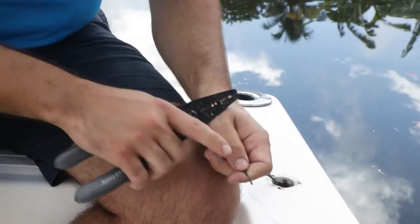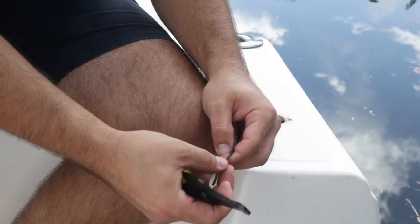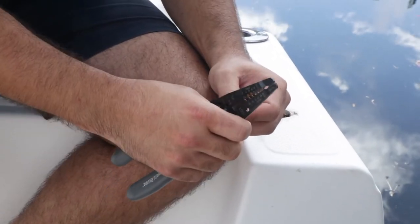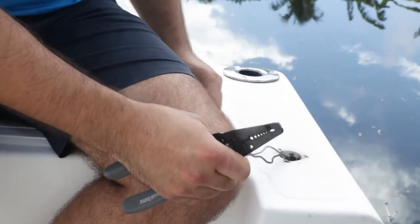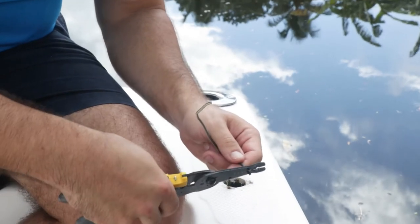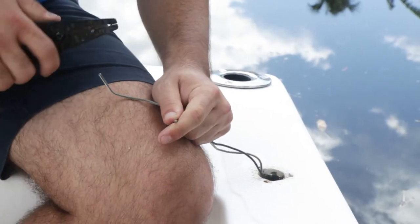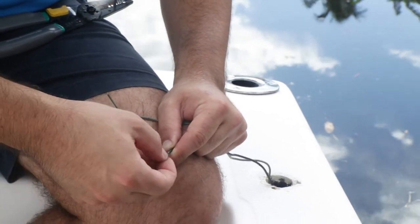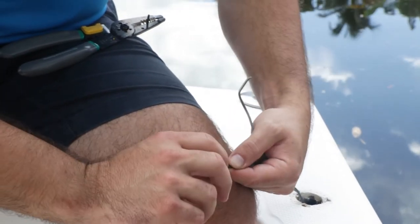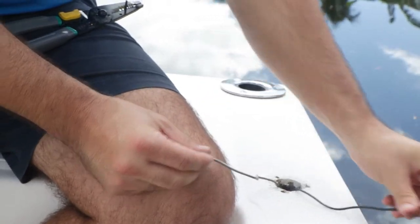Now I'm just stripping off a little bit. I've seen it — we've got a pretty decent amount of corrosion; it's pretty black. I see a little bit of blue in here. This black on its own isn't terrible — depending on the wire sometimes you'll see that — but I do see a little bit of blue corrosion in there, so I'm going to go down just a bit further and see if we get any better luck. We're going maybe a half inch up, strip it out. That's looking pretty good — a little bit of black on there but that may be from the outside wire. I don't see any blue. I can see gold in the middle; I don't see any blue anymore, which is great. I'm just going to twist this up and now it's ready for its next connection.